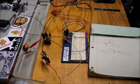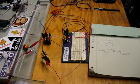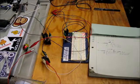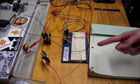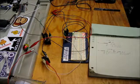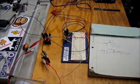Now you might be thinking, well, that's all you can have is single throw or double throw. Well, actually not. Every once in a while you can find ones with multiple poles, and every time the relay closes it advances one pole. These were very common in the old mechanical telephone switching days. Nowadays you see them so infrequently. If you see one, just buy it, because you'll probably never see another one again.